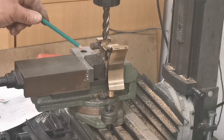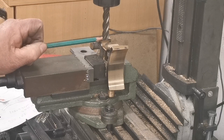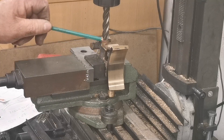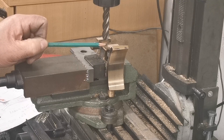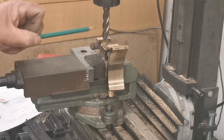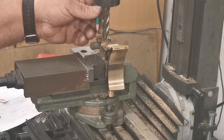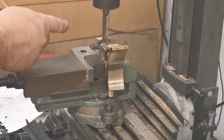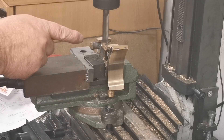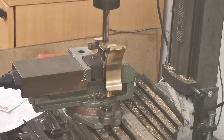From the mark on the lower one of these, which you can't see behind there, I now have to cut to a depth of 0.1875 of an inch. That just gives me enough to have a flat face for the slide bars. With the diameter of the cutter, the distance each way from center is 5/8ths of an inch, so that's 0.625 each way.